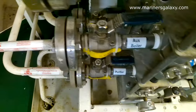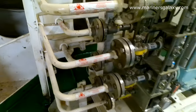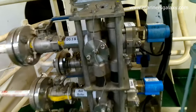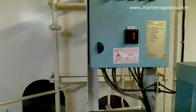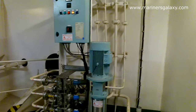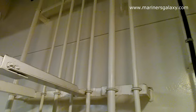These are the isolation valves on the outlet side of the unit. There is also a drain facility — if you are testing the system, you can drain the system using these. There is a vent for the pump and a pressure gauge. For testing, you open the isolation valves and the water is directed to the drain rather than to the original protected area. In some setups there are two pumps; in this setup there is only one. These are the lines going to different regions such as the main engine and boiler.